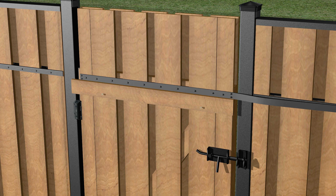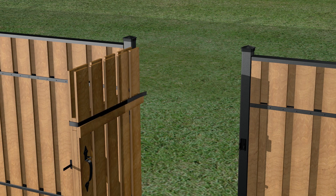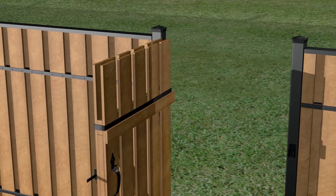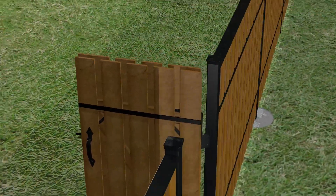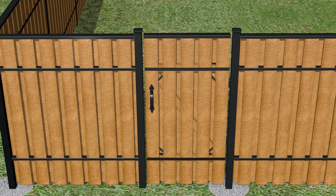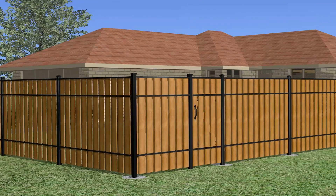Then, remove the horizontal board and take the strap around the end and continue on the opposite side of the fence, repeating the previous three steps, starting with leveling the horizontal board to act as the strap seat. Repeat this same procedure for the bottom stringer straps. Once all of the boards have been fastened, the center of the straps on the outside edge of the gate can be cut off. If you've opted for the cap rail, this is when it would be installed to the top of the finished gate. It fits snug and requires two self-drilling screws from the stringer kit, on both sides, to fasten to the top of the gate boards. Hinges can be adjusted to self-close or open by following the instructions included in the hinge bag. Taller vertical gates only require a taller frame and longer fence boards. Everything else remains the same.